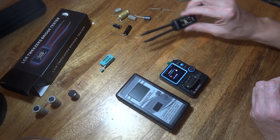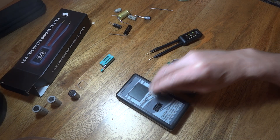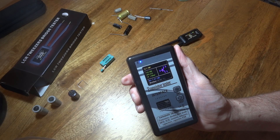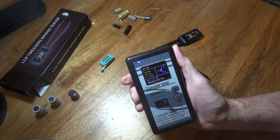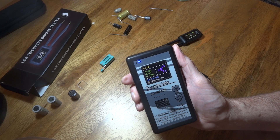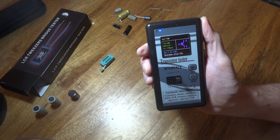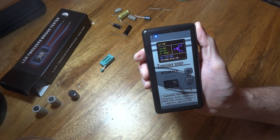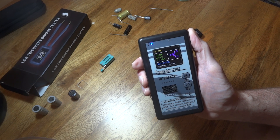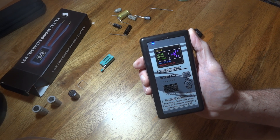These meters are mainly what I use for transistors - to tell me the pinouts and whether the transistor is working. If you're taking a transistor out of a circuit, it tells you pin 1, 2, 3 and what they are. The base is number two, three is the emitter, and one is the collector. So if you're doing substitute transistors, take the old one out, plonk it in here, and it'll tell you the pinout so you can match up base, emitter, and collector on the new one.